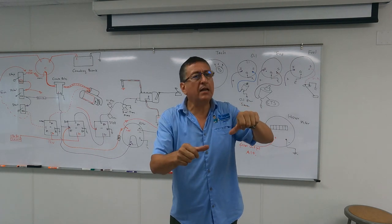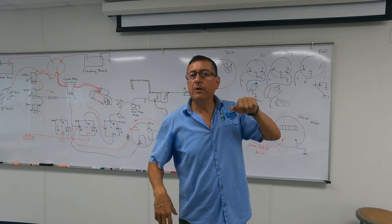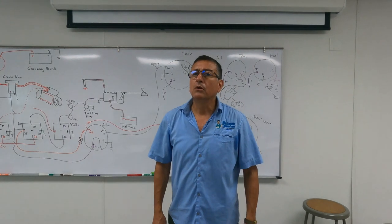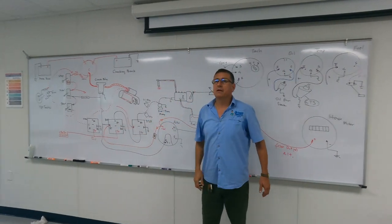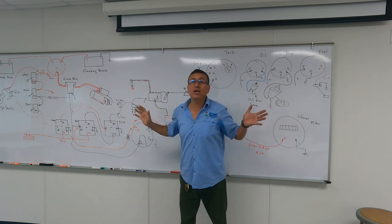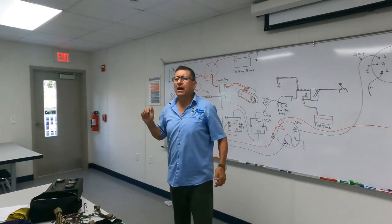I press preheat. I press start. The engine starts. I release start. It continues running. I release preheat and boom, it shuts down. Alternator exciter is not good. Okay, the current coming from the alternator is not coming in. Probably my alternator is not working. It's not producing current. How can I check that? How can I check the alternator?